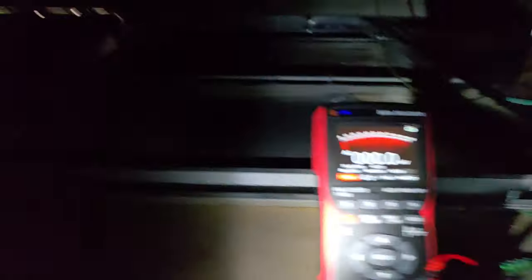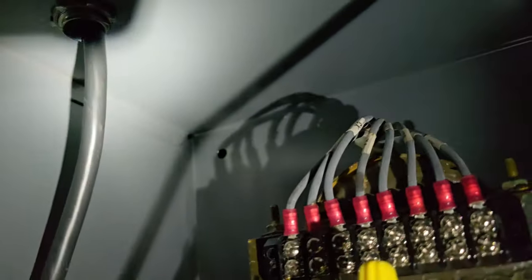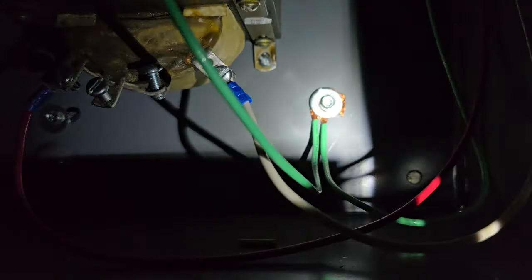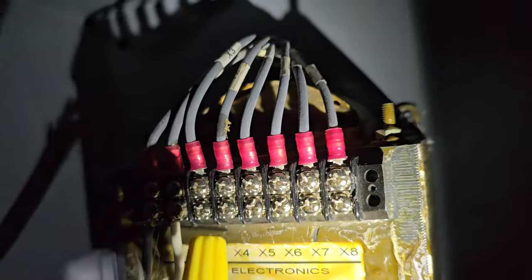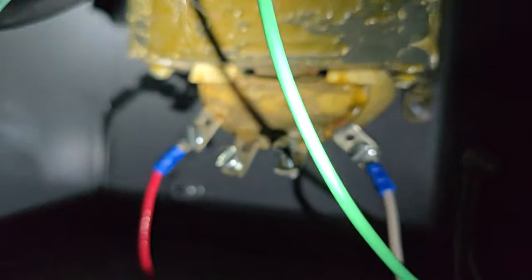See that panel? That is supposed to be here — they left this open. And you can see they brought this ground over. It's really odd. They did a knockout on the top of the box. Down here at the bottom should be the primaries, and these up here should be the secondaries — these are all your individual taps. So down at the bottom you should be seeing line voltage, and then up here you're going to see much smaller AC voltage. I've got almost nothing on my primaries.